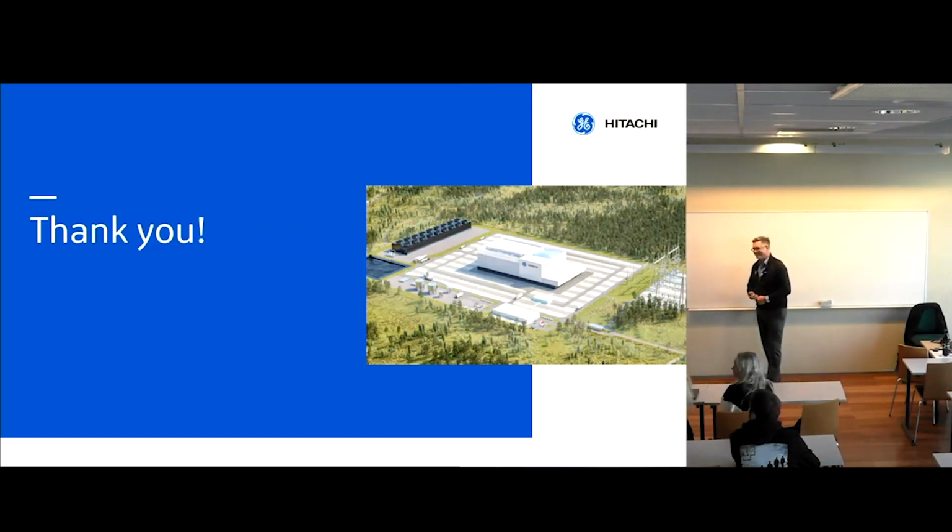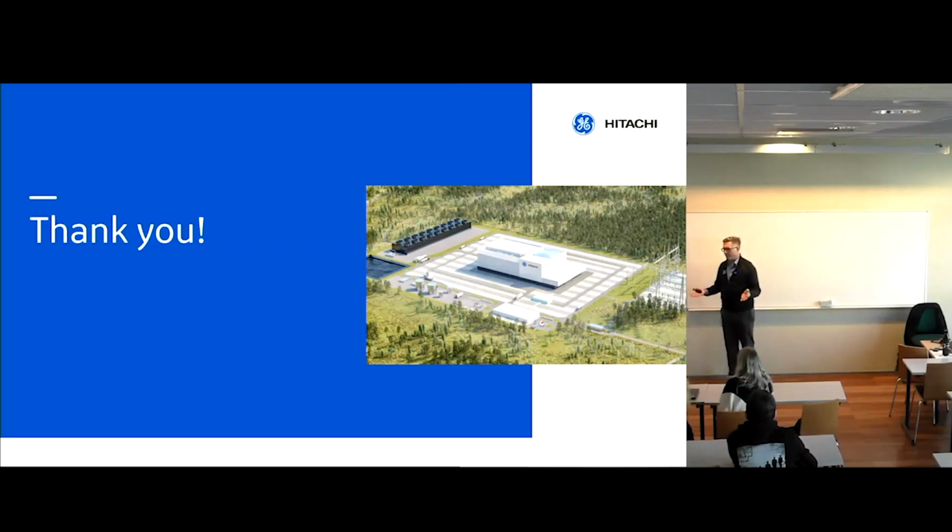Go ahead. What is the regular maintenance like? Is it once in 2 years? So there's maintenance you do all the time to repair things, and then there's downtime. You shut the reactor down for a few days every year or every other year, and it's going to be anything from 8 to 14 days depending on the scenario. Once every 15 or 20 years you need to do a real turbine outage, so that takes a little longer.